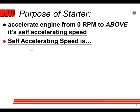Self-accelerating speed has a definition: it's the engine RPM at which, if you turn off the starter, the engine will keep speeding up to idle RPM. Let's say you start up, it gets up to 20%, you turn on the ignition — click, click — turn on the fuel. The engine accelerates up to 40% RPM, and then you let go of the starter at or after the self-accelerating speed.